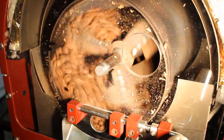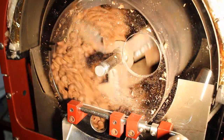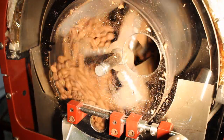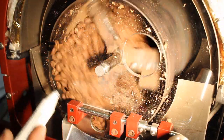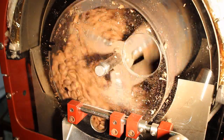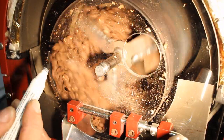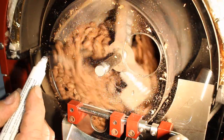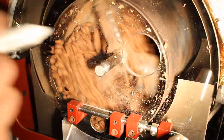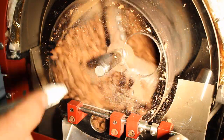Here we are at very late first crack, approaching very close to second crack. Our speed has decreased from 58 hertz down to 52 hertz — so we are slowing down. Let's check our bean temperature probe: still in a nice location, with beans travelling around it. So it's less likely to get damaged, as it's only going to be a 1.5mm probe — great temperature response and still in a great location. The beans are still tumbling nicely, still just jumping over the centre of the rotational shaft, and being pulled all the way back to the back of the drum. Beans are flowing nicely.